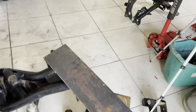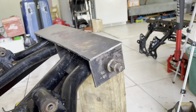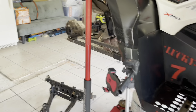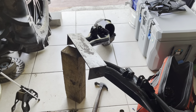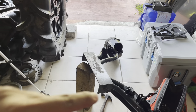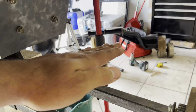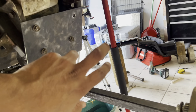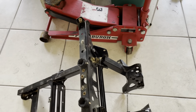I'm going to put it on there and tack weld it. The other piece has to go down here like this, so it's going to go on that frame there, just about here — that's where the middle of the bolt is. Then the top of that bracket is going to sit around here. What I'm going to do is put square tubing, weld it from here onto that plate, and then back to where the shock mount is.